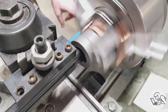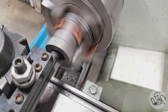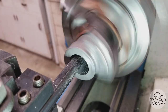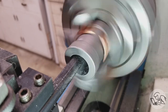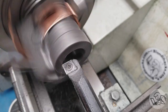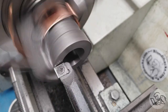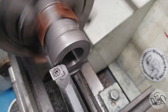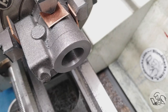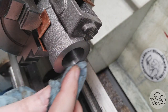Of course there's scale there to chisel our way through, but that's par for the course for the casting. After each pass I'm actually flipping the feed direction and power feeding both ways. Because there's a lot of deflection on this boring bar, it makes it easier to ensure that I get a straight bore that's going to be on dimension. Once you have a cleanup pass all the way down, here comes the really clever bit of the Keith method: you use the boring bar to face the end of the cylinder. Now you've got virtually guaranteed a perfectly square interface between the bore axis and the face of that cylinder where it's going to mount on the engine, which guarantees your bore is running true with the axis of the engine. I absolutely love this trick.